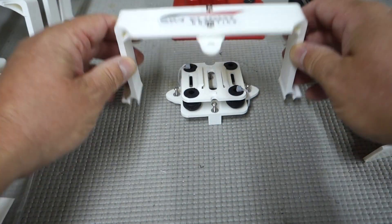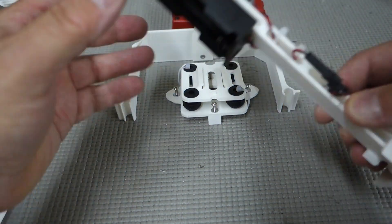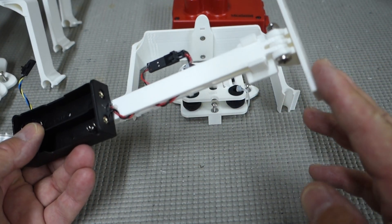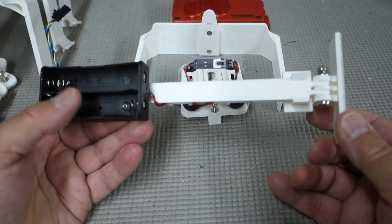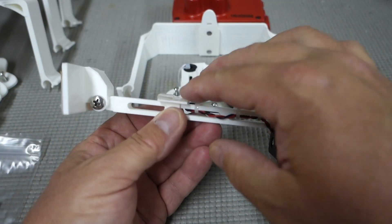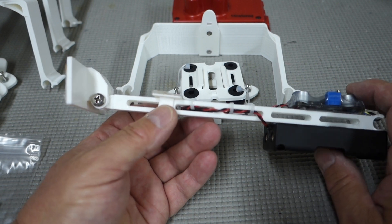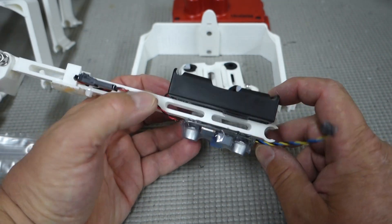You have the cradle mount that goes on the helicopter skid legs with the dovetail, and here is the downwelling light sensor platform along with your GPS module. This is double-sided very high bond tape on here. You have a clip that bonds to the side of the helicopter — there's a little bit of a step in it to allow for the curvature of the airframe, which we'll show during the airframe installation in a later video.